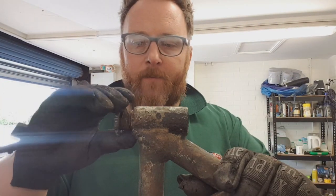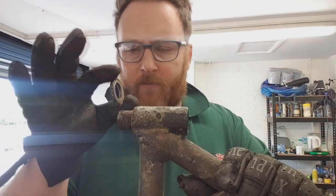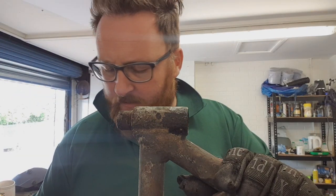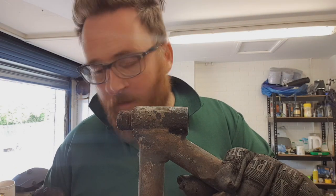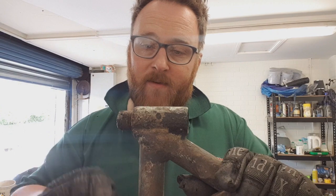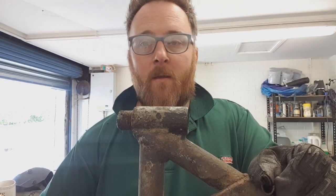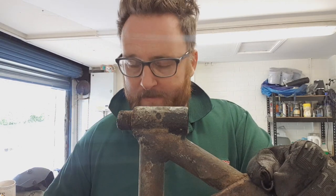What remains will be a lock nut - this is the part that actually does the fine adjustment. I've managed to get this off, which I'm quite impressed at considering the level of crust that was on it. However it doesn't look great so we might replace it - this has next to no threads left on it. This is threaded right the way in here, and I've put heat on it, I've put plus gas on it, I've put old mystic curses on it, and nothing seems to be moving it. So unfortunately we're going to have to destroy this with some big tools and take it out and replace it.